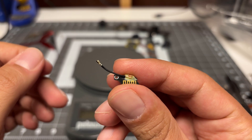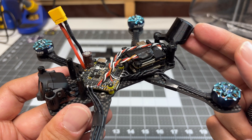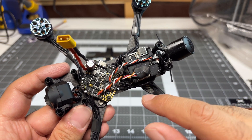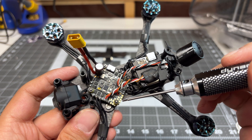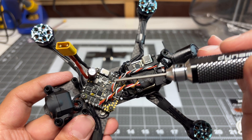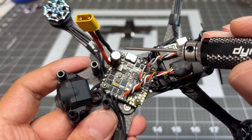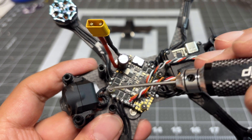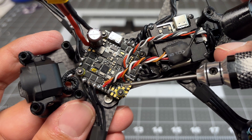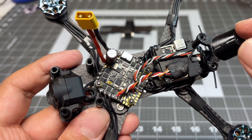We do have to figure out what to do with the antenna, but that's a problem for another day. I've gone ahead and installed the flight controller into my small Yeet 35, a 3.5 inch freestyle quad. This is the quad I previously built with the old version of the SpeedyBee AIO, and this AIO fits so much better — easier access to all the solder pads, and so many ground, V-bat, and 5 volt pads. Ultimately I came up with this orientation — it's not ideal. Usually I like battery leads coming out the front, but if I do that I can't access the USB port. Do note that the forward arrow is not pointing forward, so we'll need a small configuration update to resolve that, but it's not a big deal.